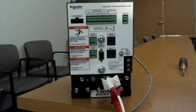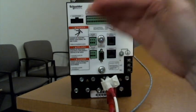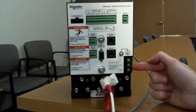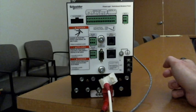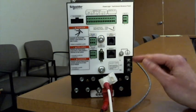And so you're actually doing kind of like a bench test on a meter, kind of like how we showed with the CTs. So this meter is completely isolated. We're running both current and voltage. And notice also this meter has a separate power supply. So you will need one of those pigtails that has the hot, neutral, and ground tied here, and that goes to a separate outlet. So you've got one outlet powering off the PowerMaster 7 series, driving it, and then you have one outlet powering off the meter itself.